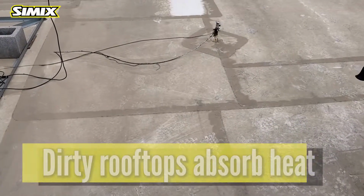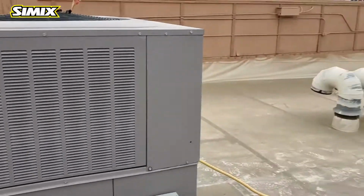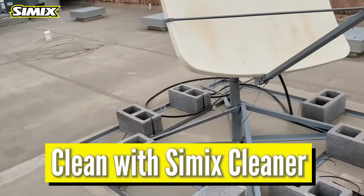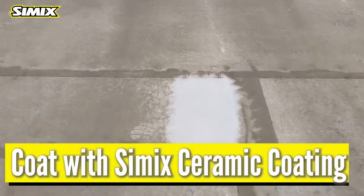We're up here on a white vinyl roof. What happens is it gets dirtier, starts absorbing heat. We're gonna go ahead and soak it with the Simix multi-surface cleaner to allow it to break down any of the dirt that's bonded to the surface. We can get it nice and clean, and then we're gonna be applying 4 coats of the Simix coating.